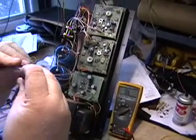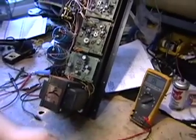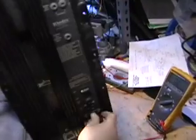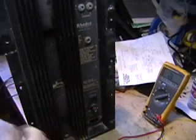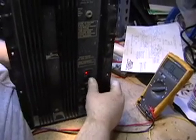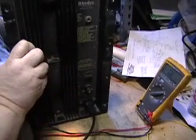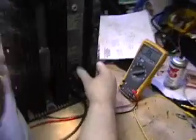We'll take a 3 amp fuse. This is a 3 amp fast. And normally what goes in here is a 3 amp slow. But we're going to put the fuse in, and we're going to power it up to prove that it doesn't blow the fuse. There we go. It doesn't. The light's still on. Okay, I'm then going to connect the board we just worked on and try it again. And it doesn't blow the fuse now.